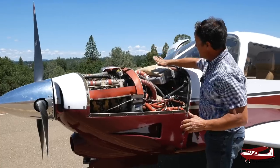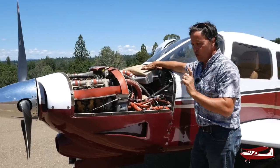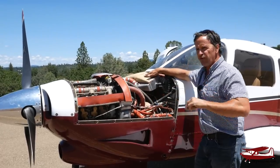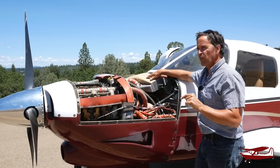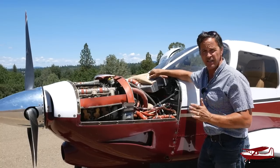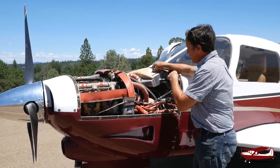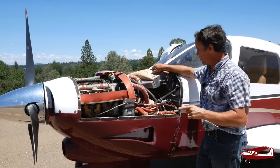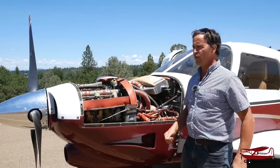So the air goes in here, and then the fuel comes, and the spark comes, and the fire comes, and you light it. But every 15 degrees that the intercooler cools the air after it's turbocharged, but before it gets to the engine, is an inch of manifold pressure that isn't shown on the manifold pressure gauge. And you think, oh, it's only an inch, who cares? Well, if you were at 10,000 feet, the intercooler will be cooling the air 60 degrees, roughly. There's a gauge in there that shows the intercooler cooling temperature gradient. 60 divided by 15 is 4. So there are 4 inches of manifold pressure not shown on the gauge at 10,000 feet. So if you want 34 and you're at 34, it's 38.